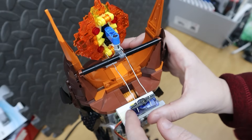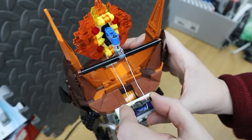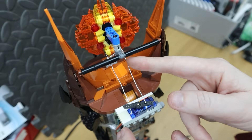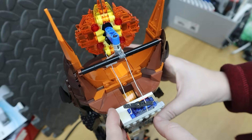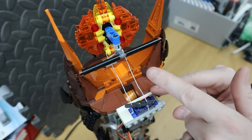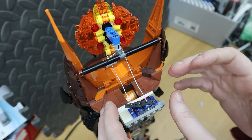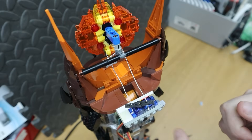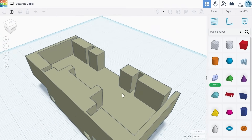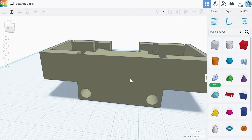I've made this little Lego cage to hold the servo in place, and when we spin the servo the eye does move left to right. But there's a lot of pressure and things keep popping off and falling off. So what I'm going to do is 3D print something — I need two of these, flipped the other way. I'm really happy with the paper clips; they work well, but I need a bit more movement. Here's the servo holder design: servos go in the top, with room for all the different parts. This is going to connect onto the tower using some Lego rods, so let's get that printed.